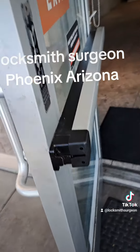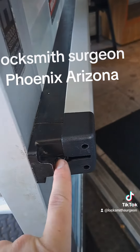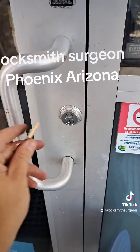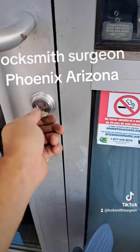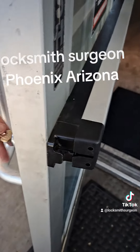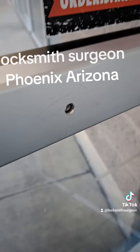After you put your two screws and the cap back on, shut the door and double check it. This is called a star wheel push bar because it uses a star wheel — that's how it locks. Shut the door and it should remain locked. Use a key, turn it to the left, and the door will open. If you want the door open at all times, you need a dog bone for the push bar, used with an Allen key.